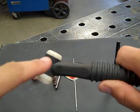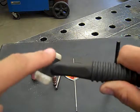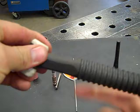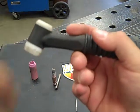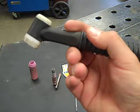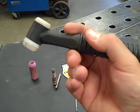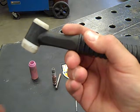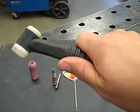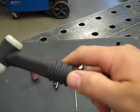You'll see the torch head has two different angles. This side here will go towards your weldment. This side will hold the end cap. The proper way of holding a TIG torch is to loop your hand underneath and hold it like such. Remember, when you get into different angles or different circumstances you may have to change your grip. Some will be held like this, others will find their own way. Make sure you're comfortable when TIG welding.